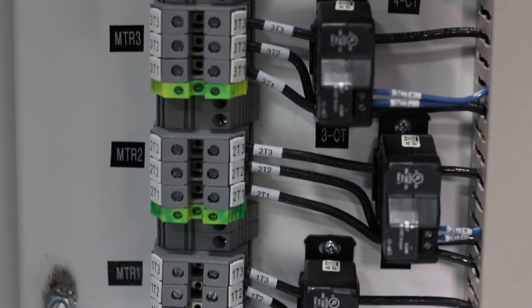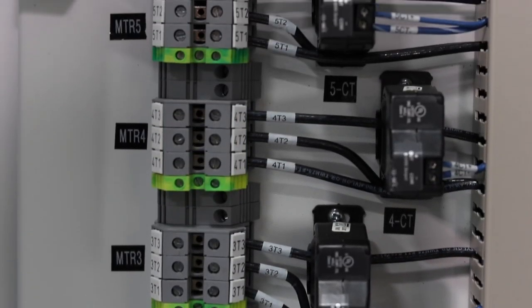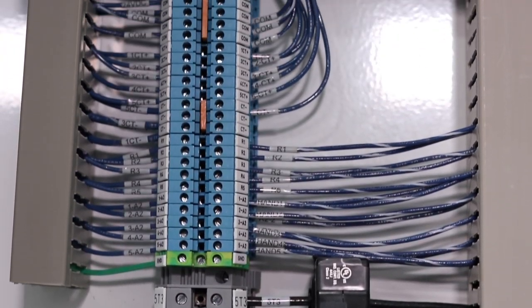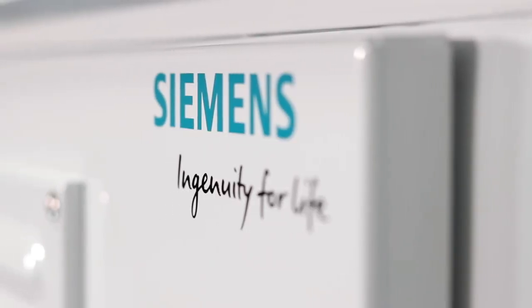Current transducers give the motor load feedback in amps to the in-situ remote control system. This allows us to monitor for events like chain breaks. If the motor load drops considerably, this indicates that something is wrong and signals personnel to check the aerator.